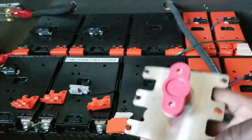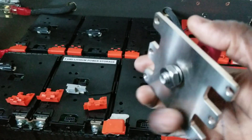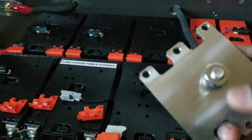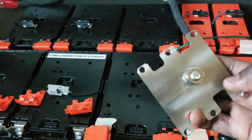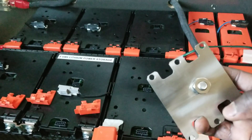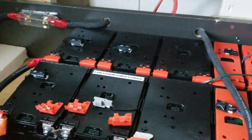When you charge, the power comes in — for example through this main cable — and it distributes evenly. Each battery is tied into one terminal and it just works out well. The power distribution is even: power coming in from the batteries going to the inverter and the main disconnect is all reading the same. The wire lengths are all the same too.